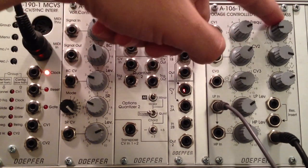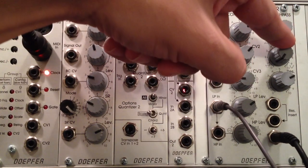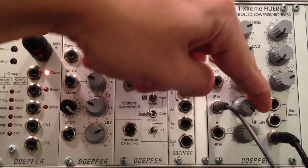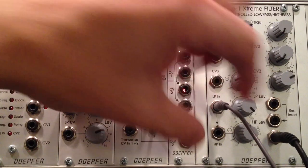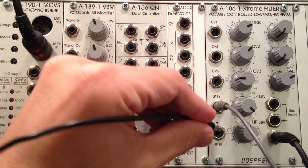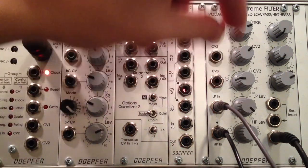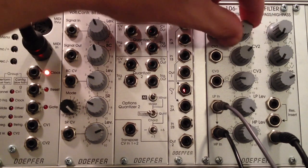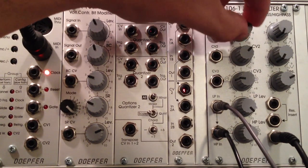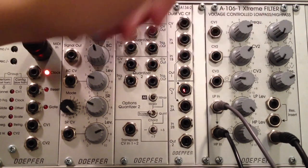I have my clipping settings adjusted already, so let me bring those down to zero and do a true test of just the low pass filter. I have my low pass all the way to the max. My high pass should be at zero — I'll patch a dummy cable in there just to be sure. So right now we should have low pass only. I bring down the cutoff, close the filter, bring it up — basic low pass filter. Everything's pretty normal so far.